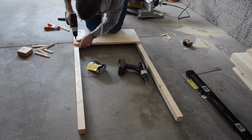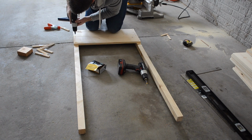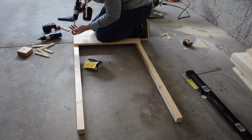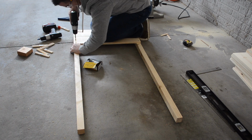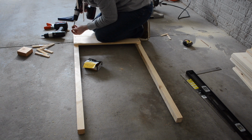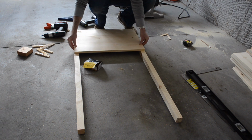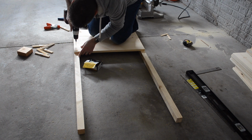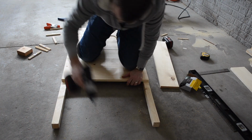This potato tower will be made of 6 stacked 1x6s on each side of the tower, totaling 24 1x6s, with each one being 2 feet long. This will create a tower that is 2 feet by 2 feet, and since a 1x6 is actually 5.5 inches in width, this tower will end up being 2.75 feet tall.